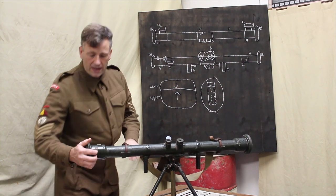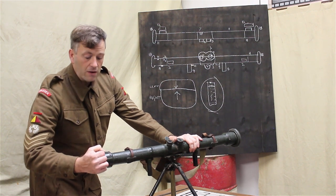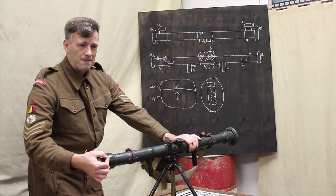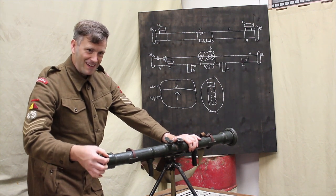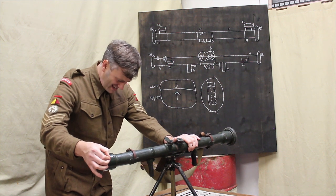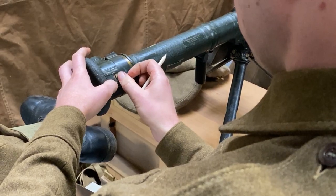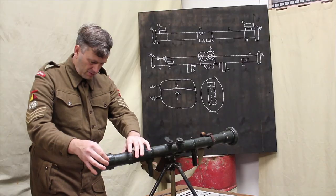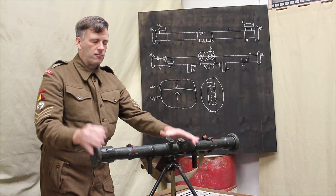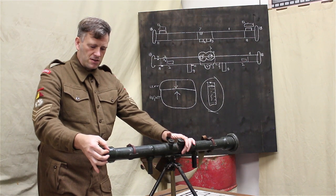And then you have a small lever that may be hidden behind a little window for you. And this is the coincidence adjusting head. And it pops out on the spring, doesn't it? So yes, that's the coincidence adjusting head. That is connected to the window just so you can revolve the image slightly if for any reason it's out, the prism is out of kilter. So you're able to take that.